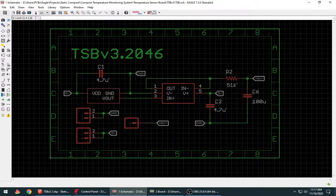Similar thing. This part did not change at all. The sensor and all the holes and everything, grounds and 5 volts. This time it's going straight into the op amps in non-inverting, and the inverting, the -1, is feeding back, so it's just the buffer and the capacitor for this one, and just a simple RC circuit to low pass filter the output, which goes to that hole